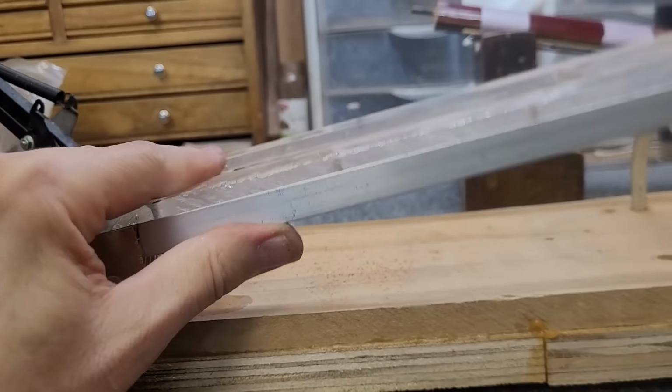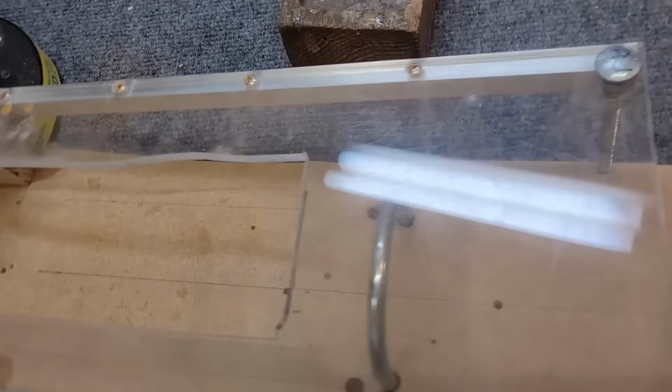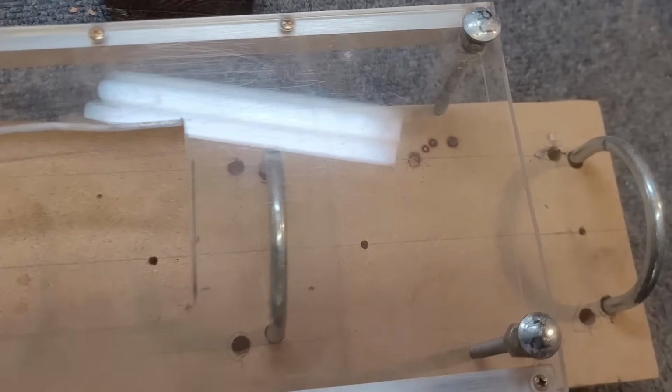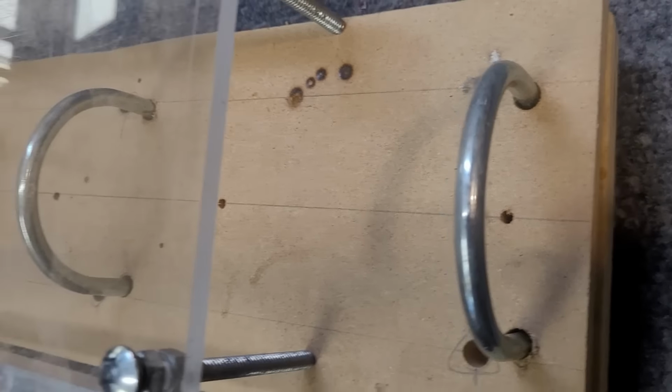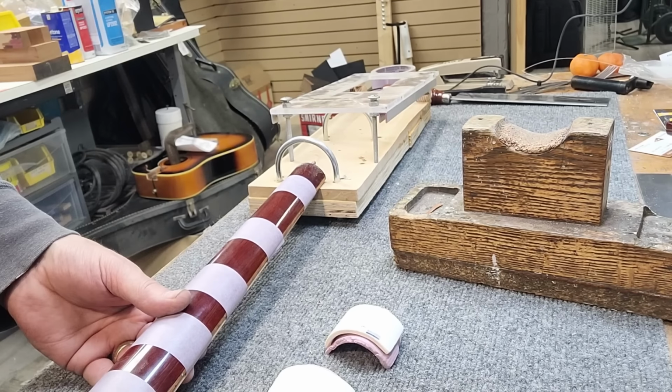I made my own wooden hinges and the scarf angle is adjusted by the long machine bolts. The pipe clamps hold the neck firmly in place. I use PVC pipe and foam pads to protect the neck. The aluminum side rails add rigidity and a smooth surface for the router guides. I need it to be adjustable so I can adapt it to different situations.